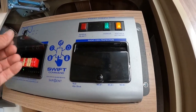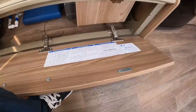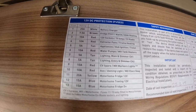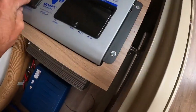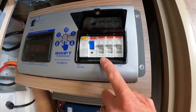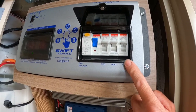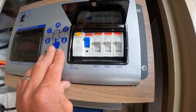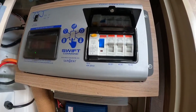We've also got our fuses — a bank of fuses. Usually on a cupboard door near this panel there'll be a little description telling us what each fuse is for, and also what our different trip switches are for. If we get a fault on any 230-volt electric items, these trip switches are going to trip out, stop the power going through, and potentially prevent electrocution. You'll also notice there's a little yellow test button, which basically just makes sure our main breaker is actually working.